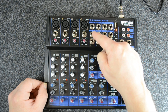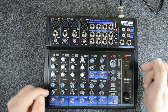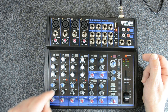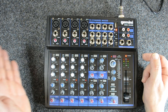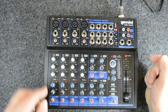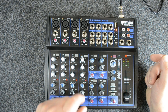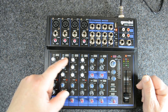On the stereo inputs over here with all the line inputs, they're all going to be balanced. Over here, because it's a single channel going to this line, we have a pan option so we can move the sound to the left or to the right. Down here we have our level, so we can adjust this unit against all the other lines going into the unit so we can come out the main on the backside. That's going to cover the first four.